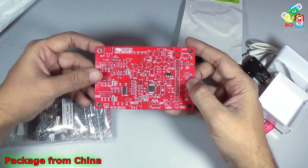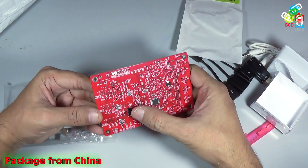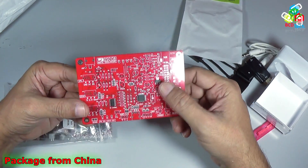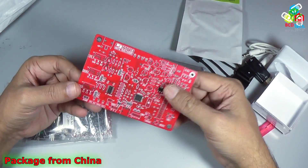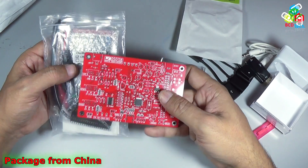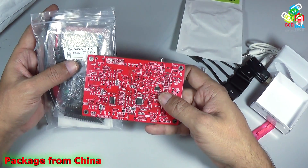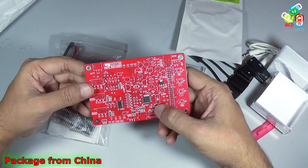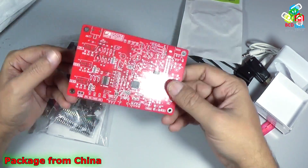You can see that it is a very nice PCB and all of the MCUs and ICs are pre-soldered on the board, including the SMD components. Nothing on the back. This is the 13803K model. For the 13804K, you have to manually solder the ICs and SMD components — that is the difference between the two models.